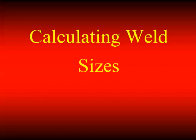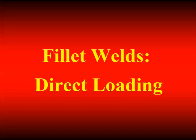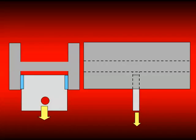We're going to look at a couple of approaches: how we handle fillet weld sizes and how we handle groups of welds subject to bending. First, the simple condition of fillet welds subject to direct loading — like a bracket underneath a rolled section where we have a fillet weld of a given length, a given force, and we need to size that weld. We assume our welds fail in shear no matter how they are loaded. In this example we obviously have a tensile loading condition, but that tensile loading ultimately causes shear along the throat of the weld.